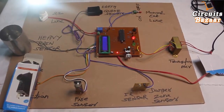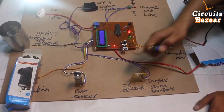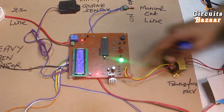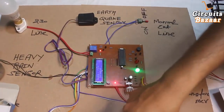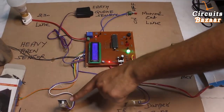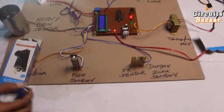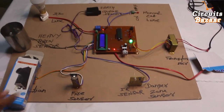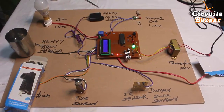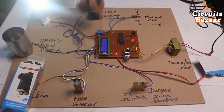The line is on again because the substation is in good condition. Now I am going to test the LPG gas sensor — you can sense smoke as well. Now 'Smoke/Fire detected' is shown on the display, and the line is cut. Whenever the smoke or LPG gas goes away from the sensor, the yellow indicator will go off. You can adjust the sensitivity using the potentiometer.